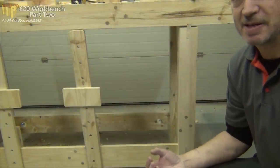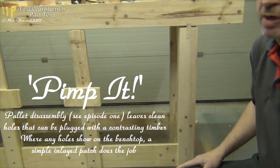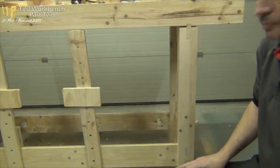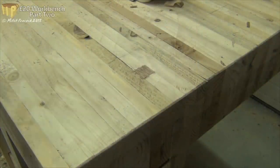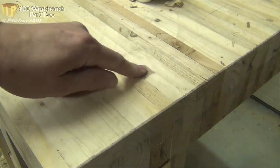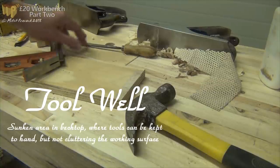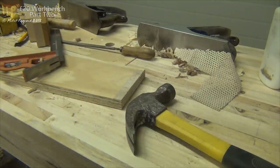As for actually tarting the bench up, what I've done so far is I've plugged the holes where the nails were in the pallet. That's worked really well. The disassembly method I used leaves lovely holes just the right size for - I think it's two plug cutters up from the one I used to get the nails out. So I've got all those holes now plugged, just looks a little bit nicer. Up on the top of the bench, a couple of spots where I've flattened the bench off, I've come close to or actually gone into where the holes were. I've just chopped those out and filled them in. And last time you would have seen there was a hole in the top of the bench which is going to be my tool well. At the moment I've got a board in there which is flush with the top of the bench, so it gives me a nice flat surface.